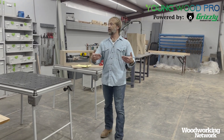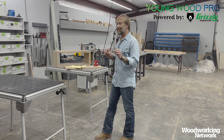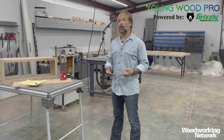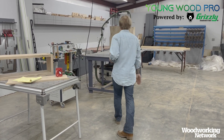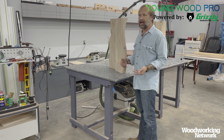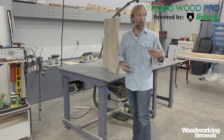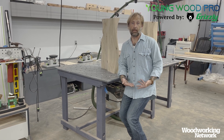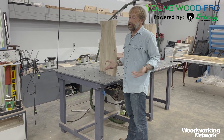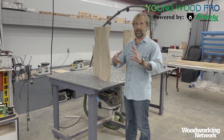However, if you're not average height — a little taller or maybe a little shorter, both are cool — I highly recommend you take the time to build at least one, maybe two workbenches at a height customized to what works for you. I found it a little bit taller just seemed to feel better on me. When you're doing this for days and months and years on end, that's wear and tear, just like a machine. I can't replace this one. I went up about two inches — made a huge difference, especially for standing tasks.